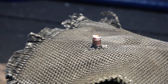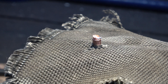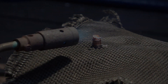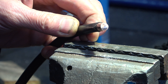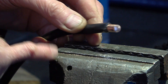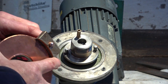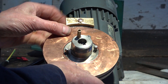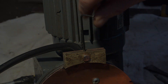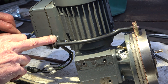I've discovered that the insulation on this flexible cable is not flame-proof, so I'll shield it as best I can. Even with that blow lamp I could only just get enough heat into that cable, because the copper was drawing so much heat away — it's actually soldered down to about here. I'm going to put a P-clip on here to hold this earth cable well away from everything, to protect it.